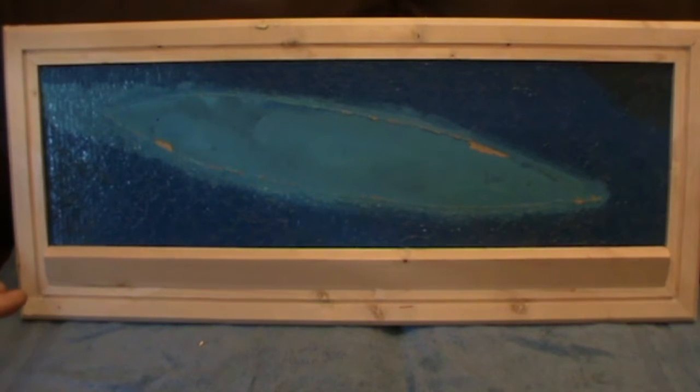I do need to blow this back apart again. I've been doing some putty work around where we've got some knots and other little imperfections. I've used the natural wood putty for that and it seems to be working a treat — it's sandable and will also take a stain. I'm going to take this apart and start the prep work, sand everything down, sand all the putty down, then apply a couple of coats of stain.